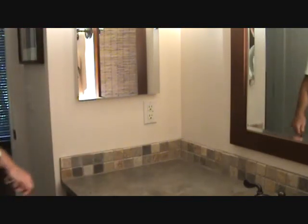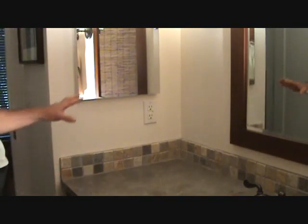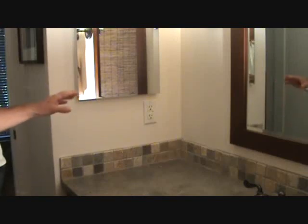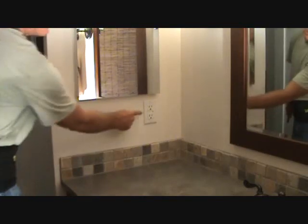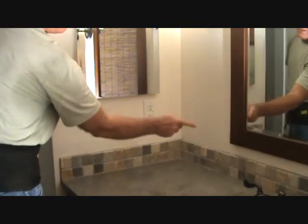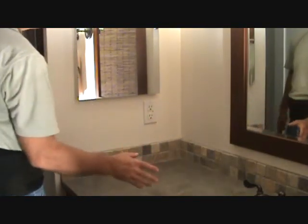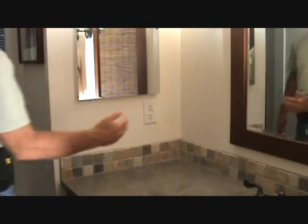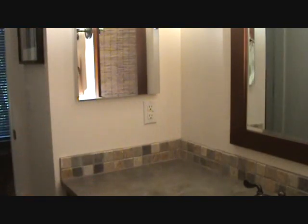Sometimes you have this type of plug mainly in your bathrooms and also in your kitchens. Sometimes this plug is connected to another plug somewhere else that may be the one that's not working, and it's because it goes back to here. Some of them are tied in, daisy-chained inside the wall, so look around next time your plugs are dead and look for a GFI to see if it needs to be reset.